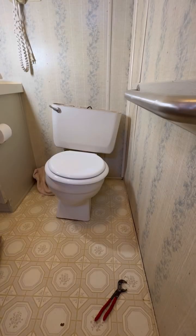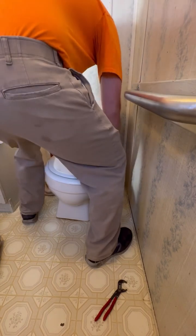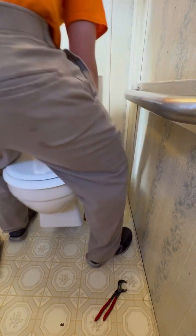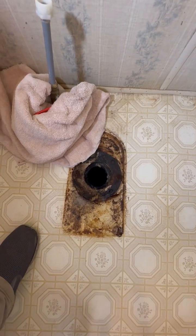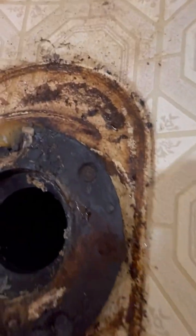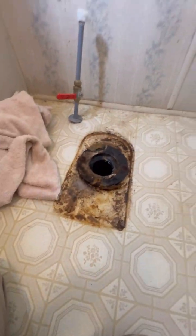Whoa, that's crazy. So let's see what we're looking at under here. Exactly what I expected — toilet hole. Now let's see if we can find out why it's messed up. From the looks of it, the wax ring dissolved and was letting water out, which was starting to pool up and damage the floor underneath it. So we'll just fix that real quick.